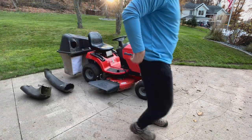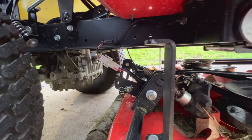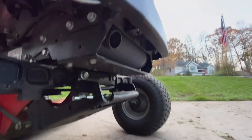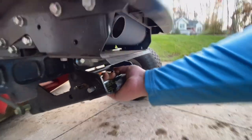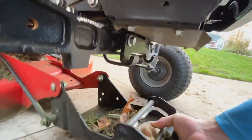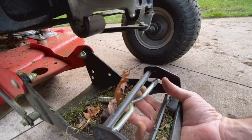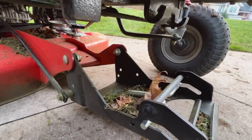I'll take the deck off. First thing you want to do is lower it down. Next, disconnect your height-of-cut motor — just pinch it there and pull it apart. Then we can disconnect the front of the deck, which has a nice handle right here. You pull in this piece which locks it in place, and then you're able to pull it up and forward to get it to drop off of its hook. This bar just rests in these hooks, so when you retract this piece it's not locked, and you pull it up off the hooks and it drops down.